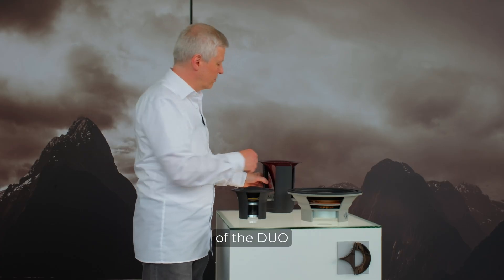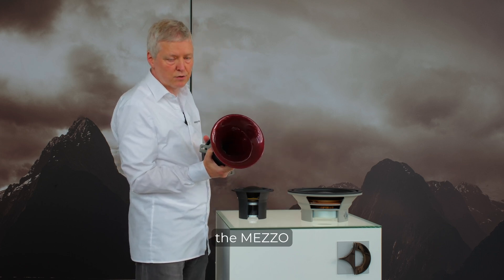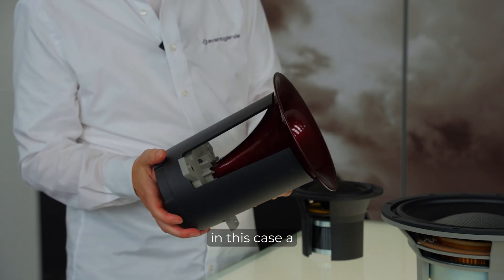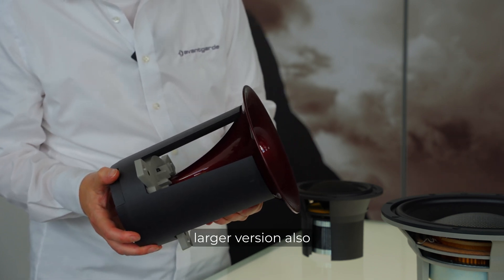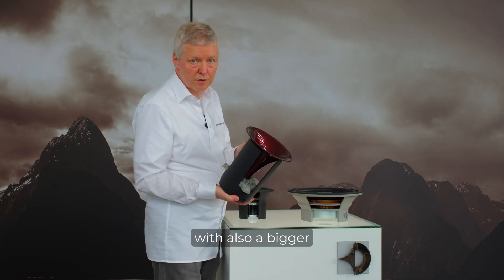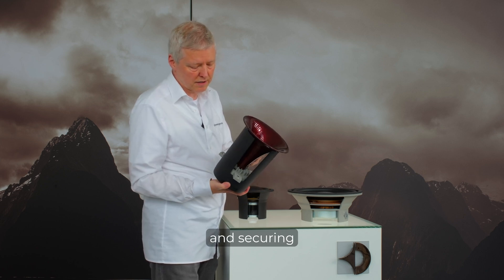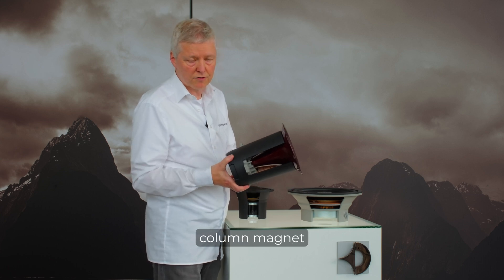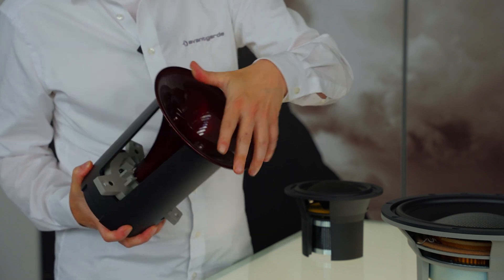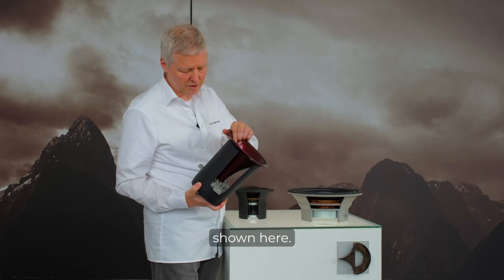Here we see the driver complement of the Duo speakers — Duo SD, Duo GT, and also of the Mezzo G3. Starting with the tweeter again, in this case a larger version, also in the cabinetry of the Uno driver with a bigger driver, but a similar structure reinforcing and securing the internal voice coil and magnet structure. And of course the bigger horn — the 8-inch horn of the Duo — also detachable, as shown here.